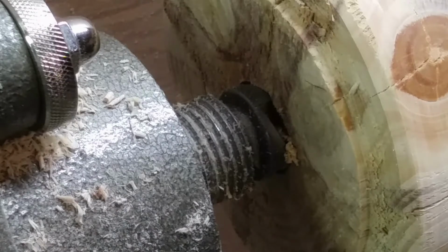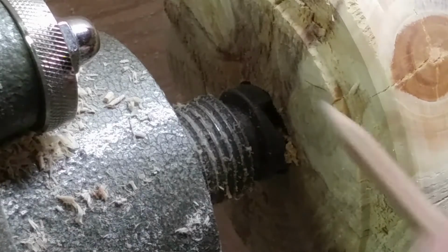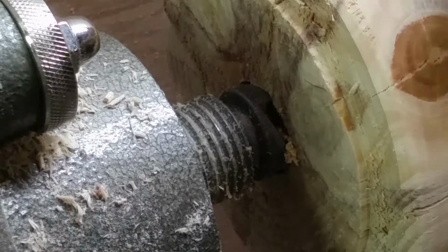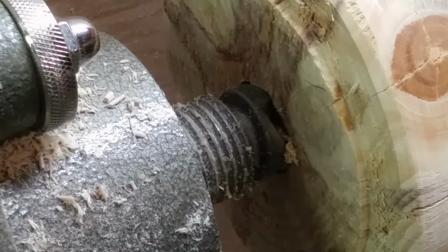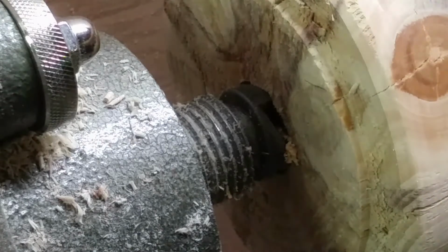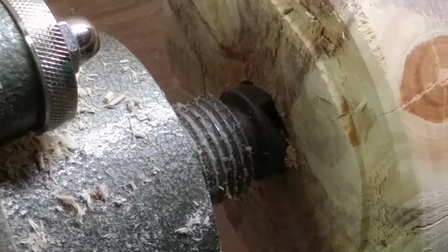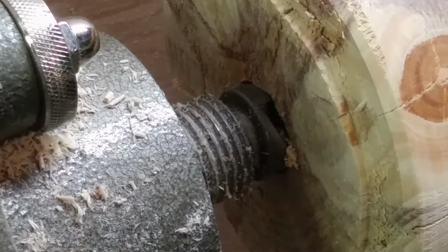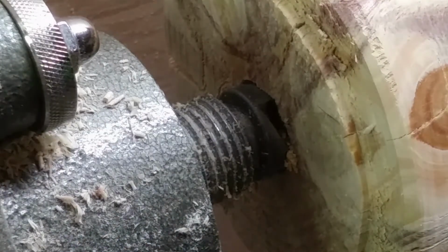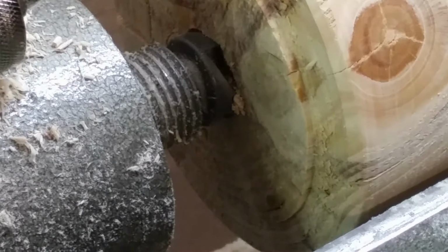So, yeah. But having the spur chuck really well lubricated really did help quite a lot. And so when I did have a jam or I was struggling to make good contact with the wood, it did act kind of as a natural clutch, just because it would allow the spur chuck to continue to spin. I don't want to yank on it right now, but besides the wood's been destroyed, this connection in the wood has been destroyed, but the spur chuck turning was really helpful. So I was actually pretty glad for that.